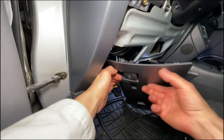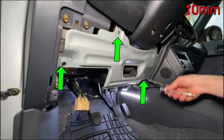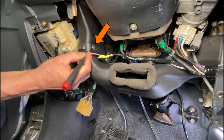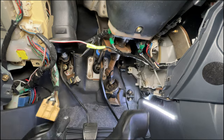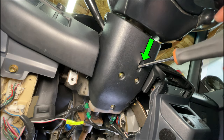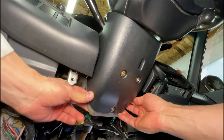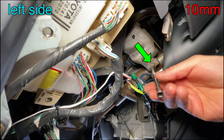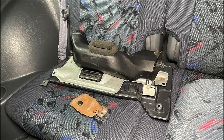It's a little bit tricky. Remove three bolts from the metal panel with a 10 millimeter socket. Push in the push pin by about three millimeters to release it, then remove the lower vent. Take one Phillips screw out of the lower steering column trim. Wiggle the panel to unsnap it from the upper plastic but don't remove it. Take out this weird piece of metal covering the steering column bolt. I made a pile of parts in the back seat to keep them organized.